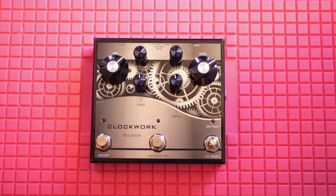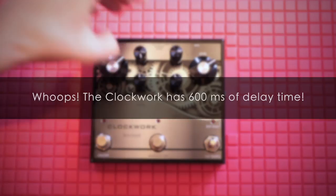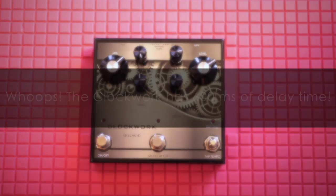The delay will always stay relative to the volume output, so you will not have an out-of-balance mix between the two. Use time to control the delay time, from almost imperceptible, which creates chorus and Leslie sounds, all the way to 600 milliseconds of delay for the long, lush sounds. Repeats. Use this to control the amount of repeats. Go from one repeat all the way to crazy oscillation.